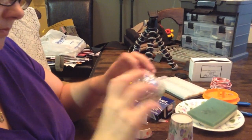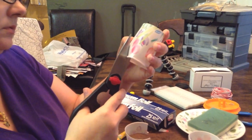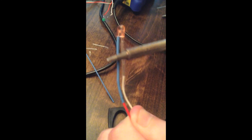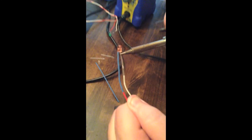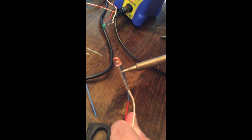I'm going to use some heat shrink. I'll work on that while you work on some more cups. So that's the idea for the cups. I slid the heat shrink over and now we're just going to use the soldering iron to kind of help shrink the tube down against the wire. That will keep it from shorting out against the other wire and the foil. They should be able to see the heat shrink collapsing down against the wire.